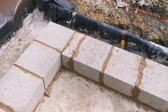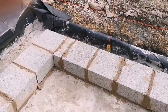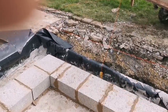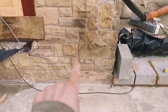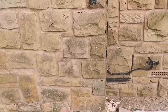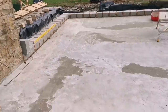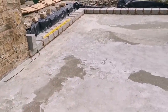On the inside blockwork, we're probably looking at a 100 block flat. We might have to cut some blocks on that. But the stone is all different sizes, we should be able to sort it out. What we want is the house damp proof course to start off straight, because it goes up, then down and up and up and down. We want it nice and flat, all on one level, and then we'll start doing random after that, because you're only going to see the first block of it anyway, 150 above the ground.